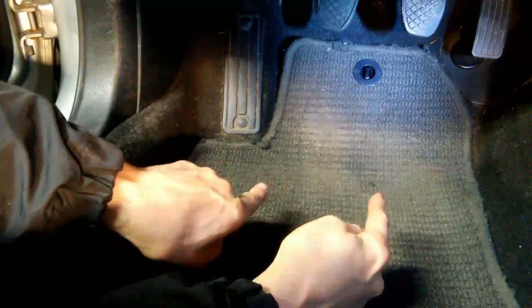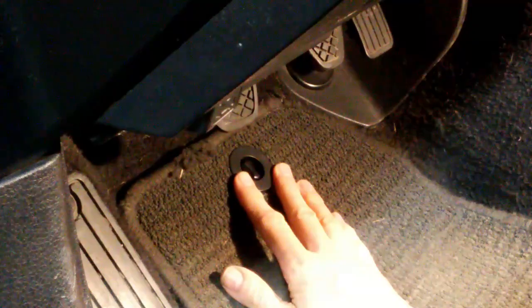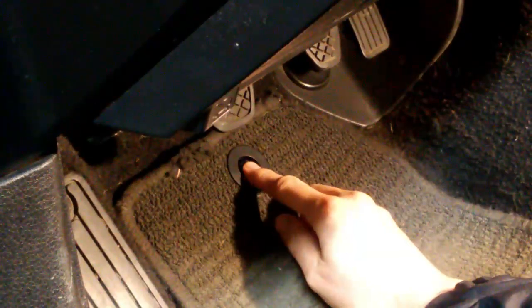In the case of the third one, I'm going to place the nail facing in the other direction. When facing in this direction, it prevents the mat from sliding forward, which is usually the problem. But it could also slide backwards, so I'm going to place this nail going the other way to prevent the carpet from coming in that direction. Laying the carpet in place — that's the final resting position. In this case, I'm going to have the needle pointing in the other direction.